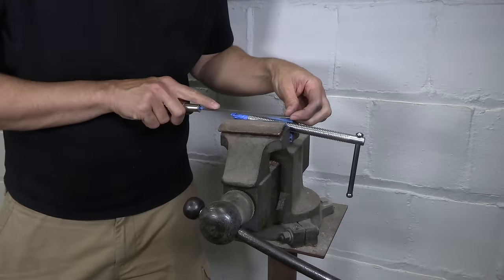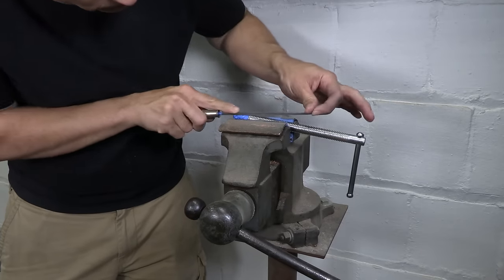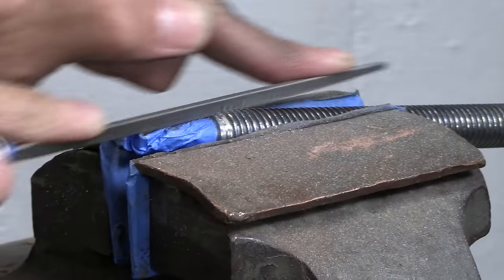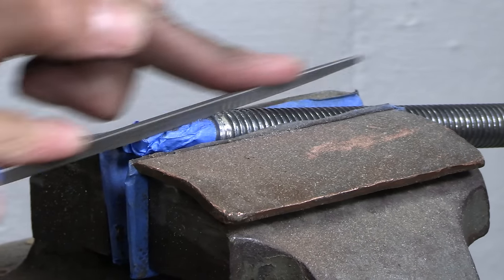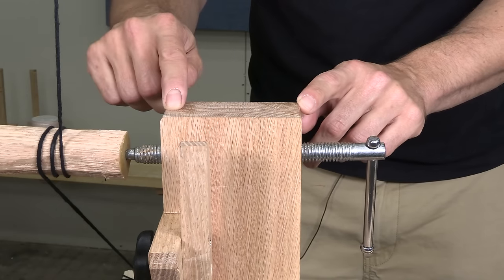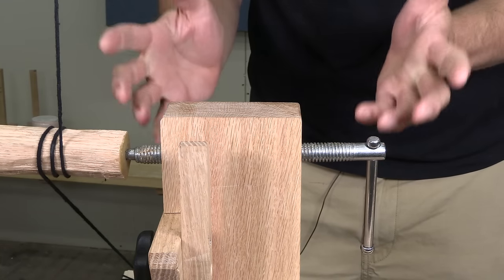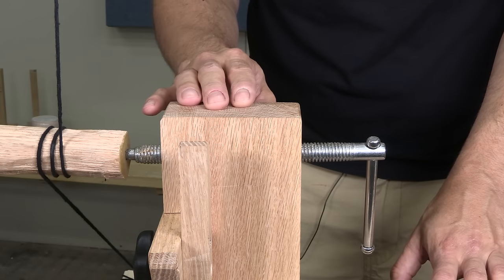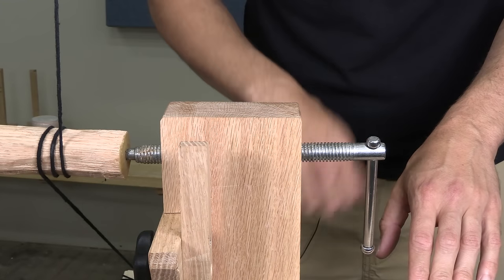As a finishing touch, I'm going to use a triangular file to cut a couple of flutes into my tapered section. This is going to make my screw better at tapping threads into the wood poppet — the flutes will give the waste somewhere to go. A big challenge with this part is drilling a straight hole all the way through this four-and-a-half-inch wide piece of wood. If you have a drill press, that's really easy, but it's more challenging for the hand-tool woodworker. But don't worry — I have a couple of great tips that are going to make this really easy.